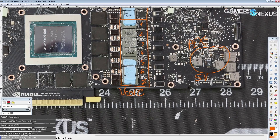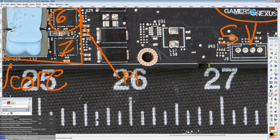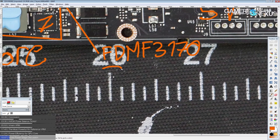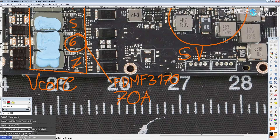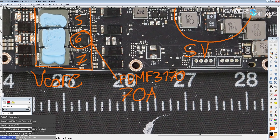For the actual power stages, we're looking at NVIDIA's favorite new power stage: the Fairchild Semiconductor FDMF3170. This is a 70-amp part, and it's actually a smart power stage — it integrates thermal protection, overcurrent protection, current monitoring, and temperature monitoring directly into the power stage, which is then read back by compatible voltage controllers.